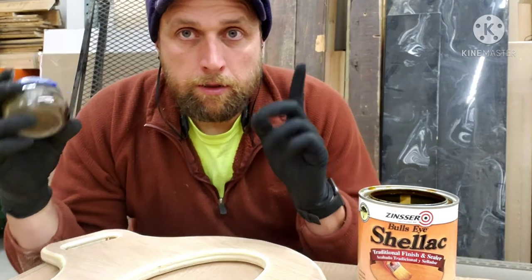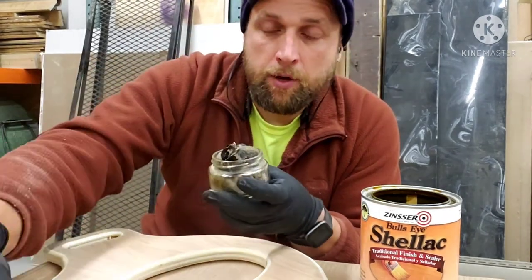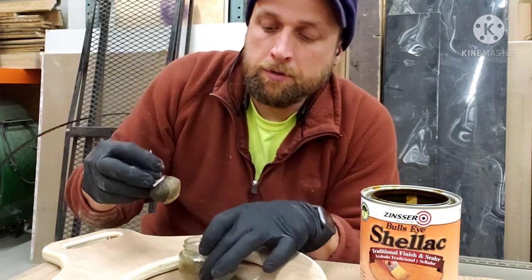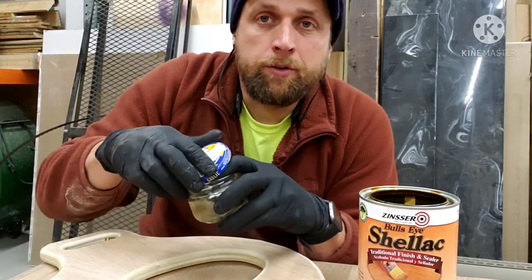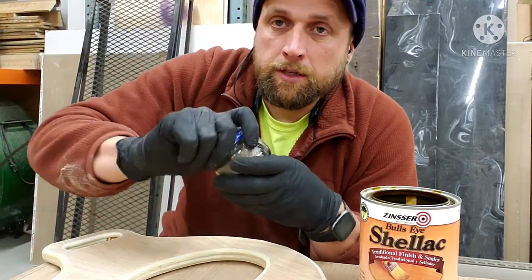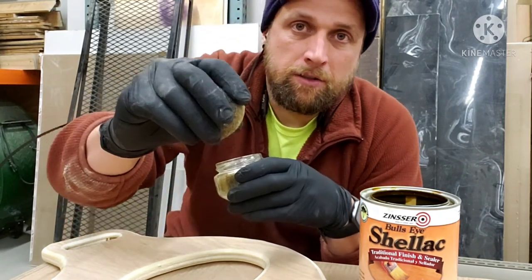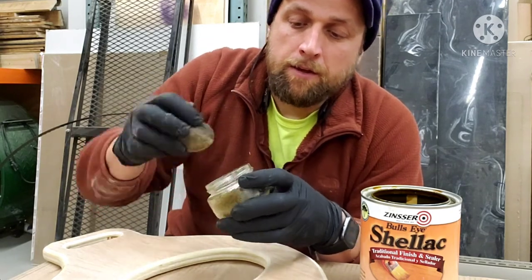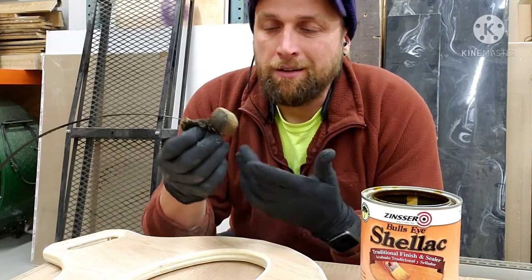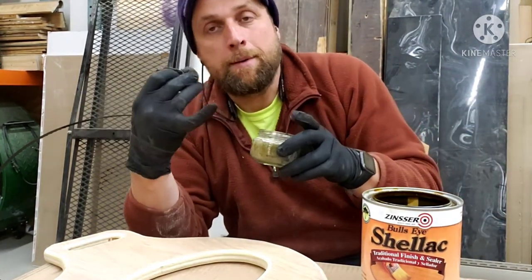For anybody that's longtime followers, little drops of wisdom when I have them — shellac. One of the best things. I wish I could give credit to somebody where I end up getting it from, but it was awesome. Take an old sock, some material, twist it around and make a dauber. You don't want to have to do it a million times over. Little baby food jars — in this case an old garlic jar — seal it off. Literally the last time I opened this was probably well over a year ago, and this is still just dripping soft; it's already pre-soaked in this amber shellac. That way you can just pull this out, dip it in, and go. You don't want to have to keep redoing these — also it's just wasteful, then you got to go put it in the trash, worry about fires and things like that. Seal it in a little jar. Last time I used this was well over a year ago.